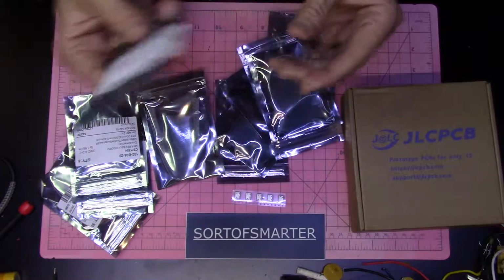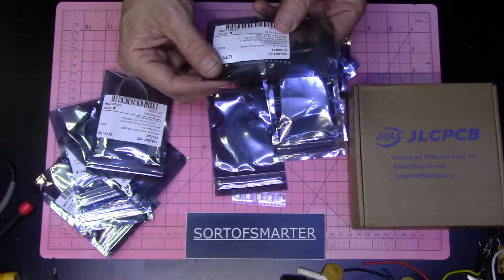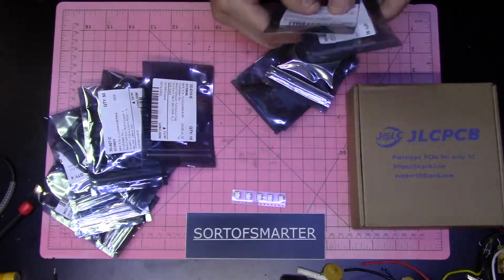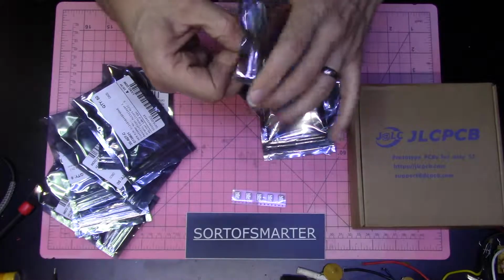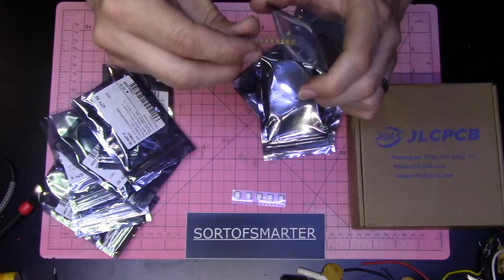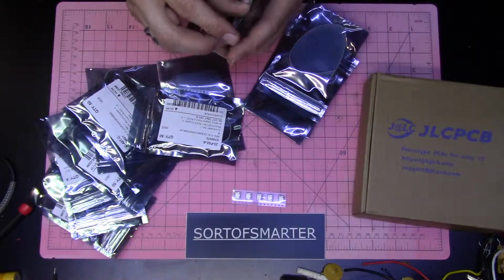Another 0805 220 ohm resistor. Just a whole bunch of resistors. 180 ohm resistor. Here's a capacitor, 100 nanofarad, 0805. Here's a tantalum, 10 microfarad. Obviously, mucho small. Here is another capacitor, 20 picofarad. I'm going to have to read that.